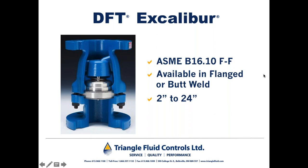A typical application for the DFT Excalibur, it's a popular valve for the discharge of high pressure boiler feed water pumps, as an example. That occurs typically in the oil and gas business in SAGD operations, which stands for steam assisted gravity drainage. The boiler feed water discharge is a very critical service. If those pumps go down, the entire operation will go down. So those end users are highly dependent on DFT Excalibur check valves.